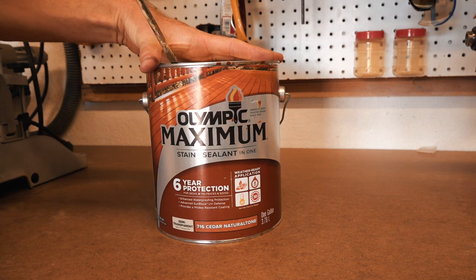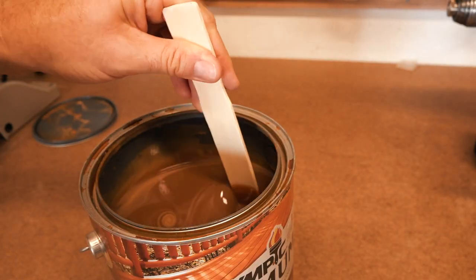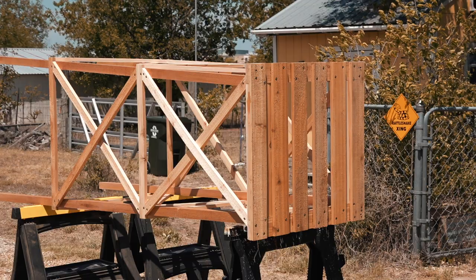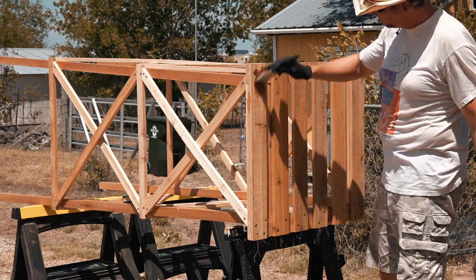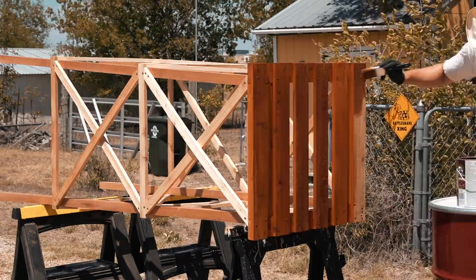And that's almost it. Now for my favorite part: painting — or in this case staining. Cedar itself is very rot resistant without any protection. However, applying this stain will keep it from going gray over time and it just looks a lot nicer.